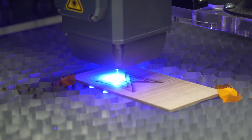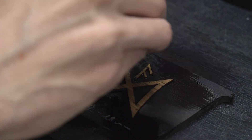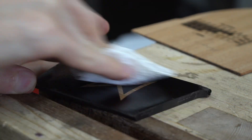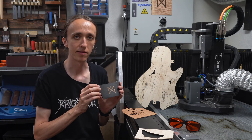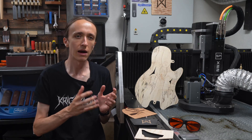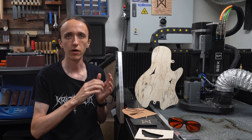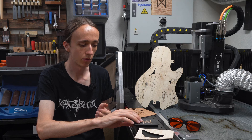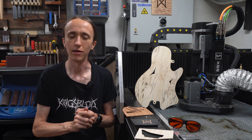Usually I do this inlay process on my CNC, which works great. However, one big downside of CNC inlay is that you cannot do sharp corners, because an end mill is just so wide. Even a very tiny end mill — I go down to like 0.3 millimeter end mills — is still quite a bit larger of a radius than what you can do with a laser cutter. It is also a lot faster if you're doing very small details, as those tiny end mills take forever to cut anything. This technique of deep engraving on wood will work great on species that do not have pronounced grain, because if you have a lot of grain, the lighter parts will burn away much quicker and the darker parts not as fast, leaving you an uneven bottom. Things like ebony or mahogany with very fine grain will work great, but something like ash I would not expect this to work.